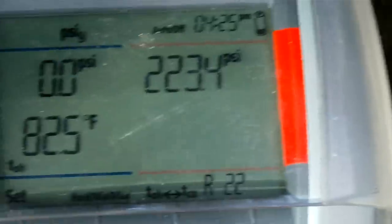Now, I took the coil out and everything. It's over here. I took the coil out, everything out. Let's have some fun over here. I got this thing pressurized, put the pressure in again, still waiting for it to drop. Not dropping. Somebody said there was a leak over here. Where's my spray bottle? Let's spray this. Spray this baby up. Let's find any leak in this thing. This is soap, so you guys don't get it toxic.